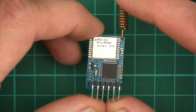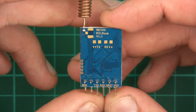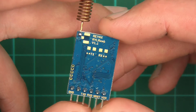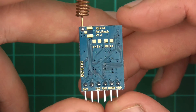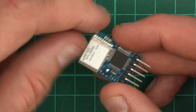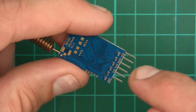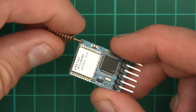What's even more cool about this module is the pinout. If I look at the pinout, you can see it's also quite peculiar. You can see it says ground, TXD, RXD, NRST, and VDD. Ground is ground, VDD is plus voltage — 3.3V in this case. We've got TXD and RXD. Forget NRST, because I won't be doing anything with that. And that's really cool, because this is a serial device — a serial transceiver. Essentially what you do is connect your Arduino, and instead of having to faff about with libraries and all that, you simply send what you want to transmit via serial. So you connect Arduino TXD to RXD of this, and then you send the message via serial, and this simply transmits it for you.